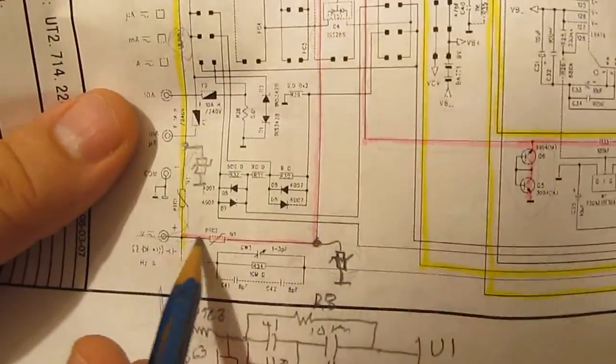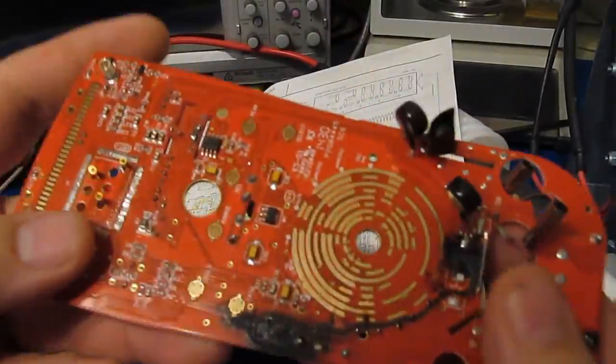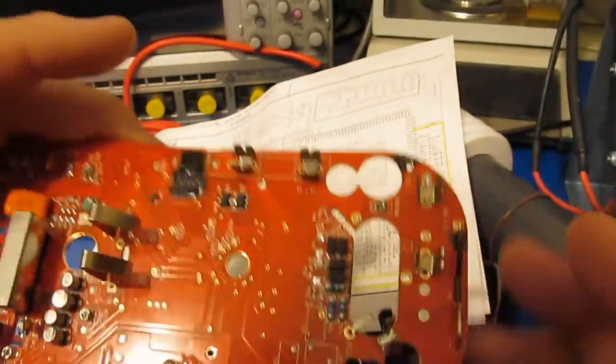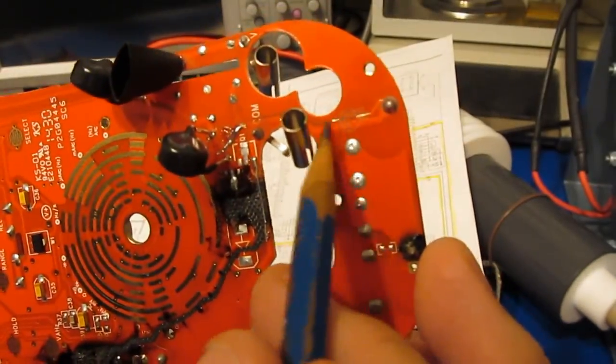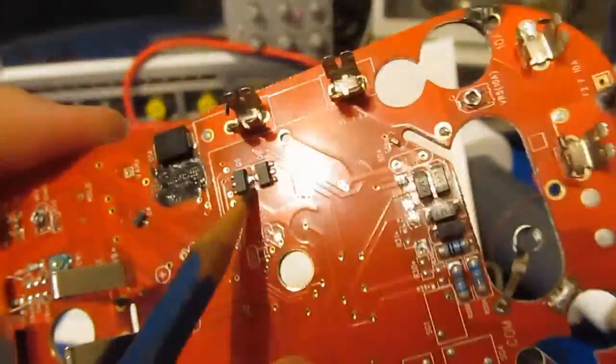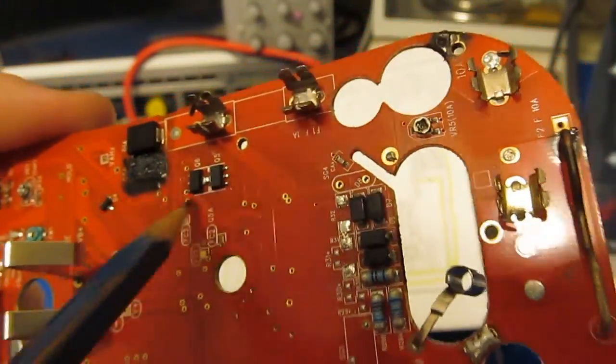So why am I not worried about this leg? Well, I haven't damaged these set of transistors yet. And when I ran 5KY's meter, of course I ran this at a much higher transient. That's what's actually damaged this ground trace up in here. So I ran this meter through all the same modes with a much bigger transient, and for some reason these lived.